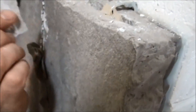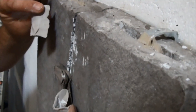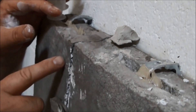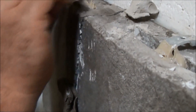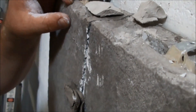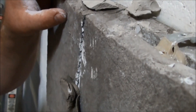The next day when you come back, the clay will be very brittle — it lightens in color. You can knock the heavy stuff off with a margin trowel. All of the clay will come off that way; you might have a little bit of residue on the sides, but with just water and a stiff brush you'll get any residual clay residue off. What you should be left with is a filled void and a good repair.